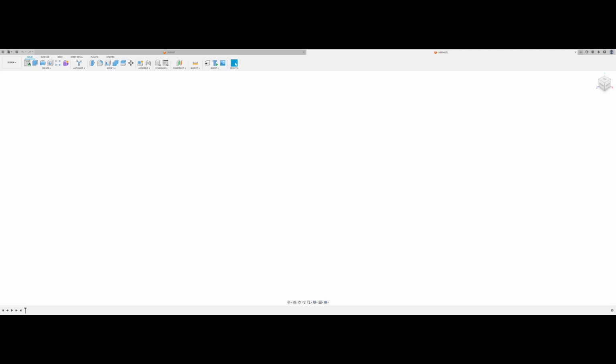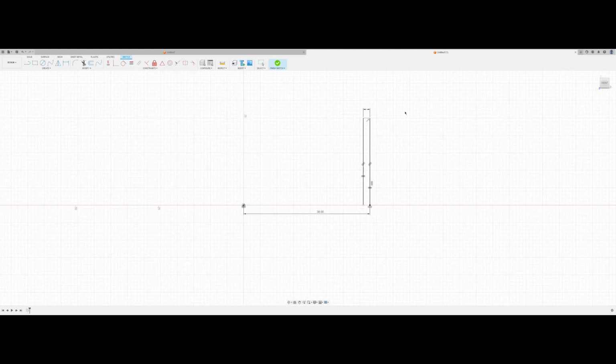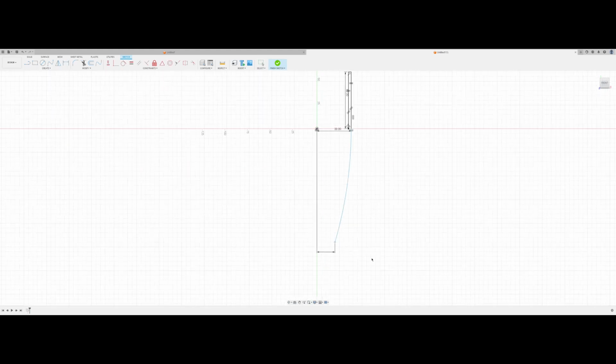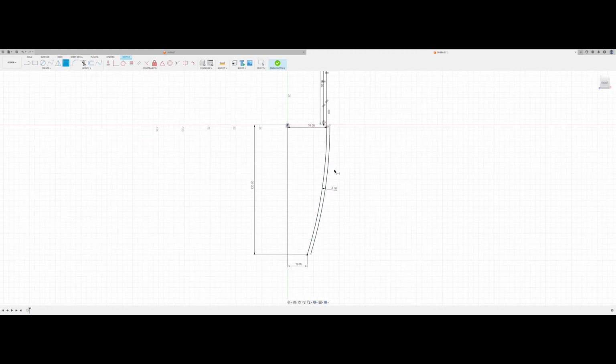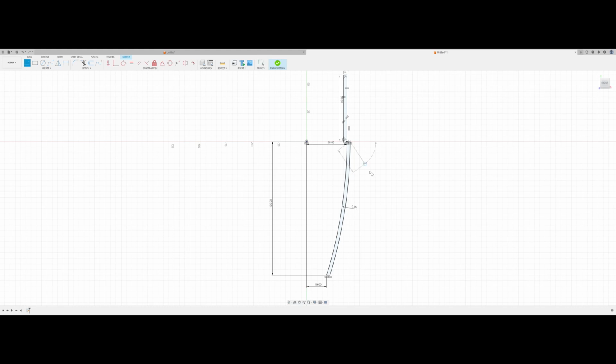Finally, we can talk about vacuum bagging molds. Just like with the mandrel method that we just discussed, a vacuum bagged part like this will only really have a defined dimension on one side. In this case, the controlled dimensions are going to be on the outside, as that will allow for the fin can to be more easily integrated into the rest of the rocket.